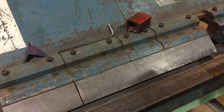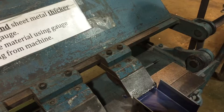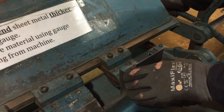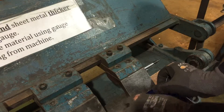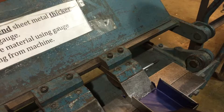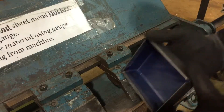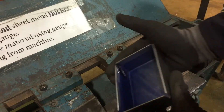Now we can move over to the other finger that I put on here, and hopefully these tabs will clear. We'll clamp on our line, then fold up making sure our tabs hit nicely. Now you can see the box starting to form, and then we'll hit these tabs. You can see why I made the pan about 3 and 1/8 — so I had a little bit of clearance when doing this tab construction. If you weren't using tab construction and maybe going to weld those corners with 16 gauge, then you might be able to go right on 3 inches. A little bit of clamping back together, and then maybe over to the spot welder to get this little box welded together. You could also use pop rivets, or if you're really good, use the TIG welder to close up these little seams.